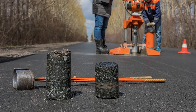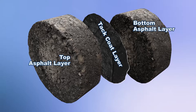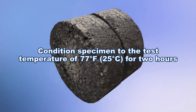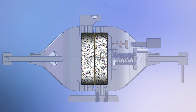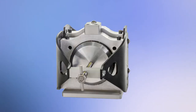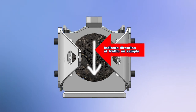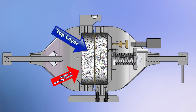To perform the ISS test method, four or six inch diameter field extracted cores or laboratory compacted samples consisting of two asphalt layers bonded with tack coat material are conditioned according to test specifications and then placed within the testing apparatus. The interlayer or tack coat layer is positioned in the center of the shear plane gap between the moving and stationary frames. For field extracted cores, the direction of traffic should be indicated on the sample and when mounted in the apparatus, the sample should be oriented such that the direction of traffic is vertical and with the top layer positioned on the shearing side.